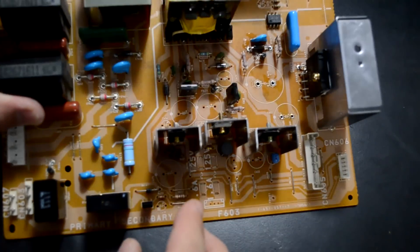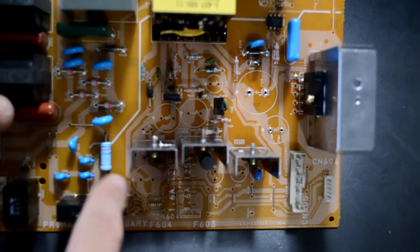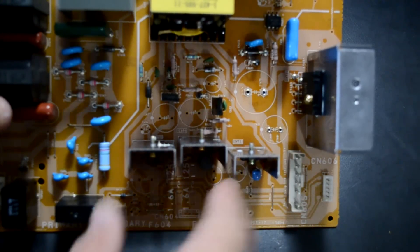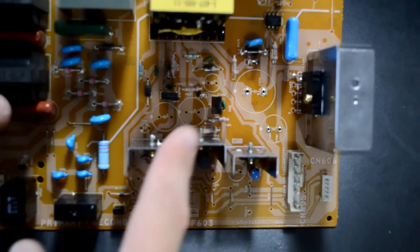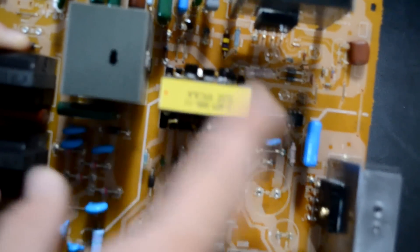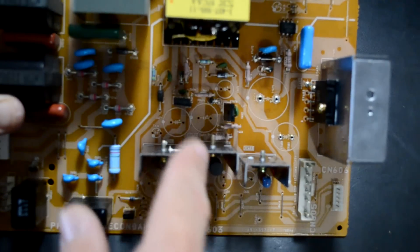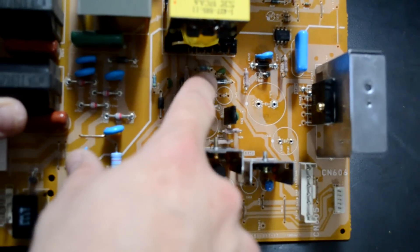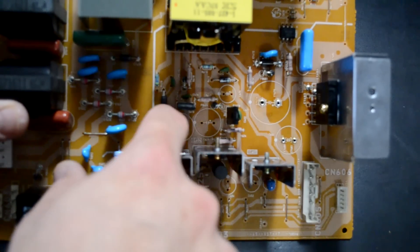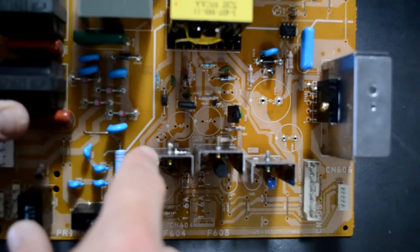I just finished pulling all the capacitors — down in this area, over in this area, and up in this area. If you look at this board, you should see how this white line covers and isolates this area. This is one of the highest-heat areas of the PVM board, running through those lines and especially around those heat sinks. This is where the majority of our heat is going. So anything in that area — electrolytic caps, other components — if they don't look good or look burned out, check them. That's why they made some extra high legs on these resistors, to help reduce the heat they'd be touching on the board.